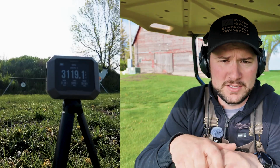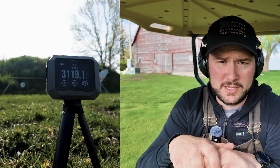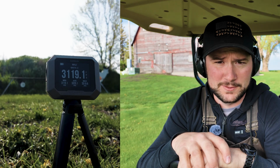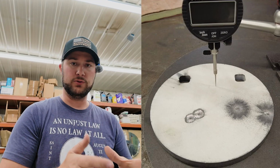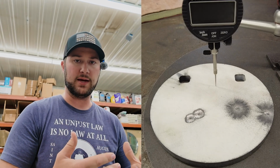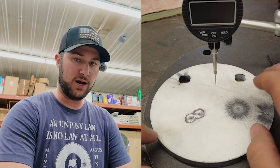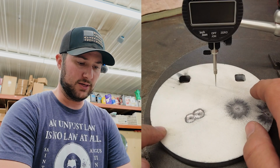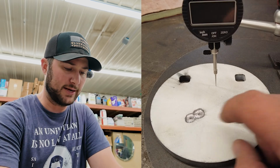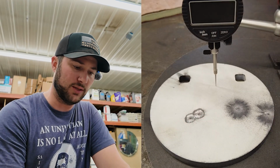We'll reconvene this video at the shop where I'm gonna measure the pits and review the video and see exactly what the velocities were. All right, I'm back in the shop, going to show you the setup here. We're gonna test these and show you the effect on pitting that velocity has. So first off, you can see how this plate rocks. That's because that 100-yard impact actually caused deformation on the back side of the plate.